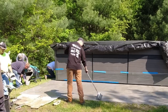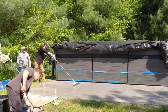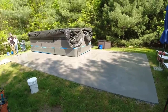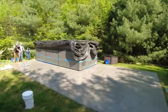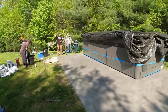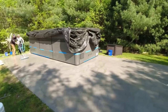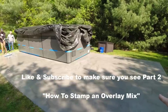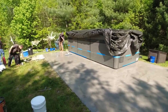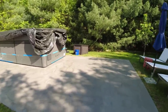Tyler had to go over my work — I guess I didn't do a good enough job. He's just being a perfectionist. So that's the basic process: mixing station with guys mixing and dumping, one guy gauge raking, one guy smoothing, one guy doing the edges. Now it's just a matter of letting it set up and cure enough to get on it with the stamps. With an overlay like this at three-eighths of an inch, you want to touch it with your hand — it'll still be soft, but when you lift your hand there should be no overlay mix on it. The surface has to be dry to the touch but soft underneath. We'll be back in a few minutes to show you the stamping process.